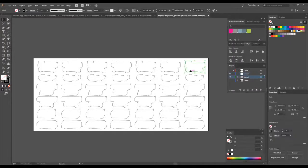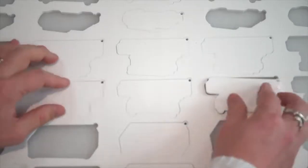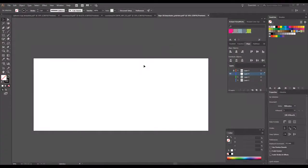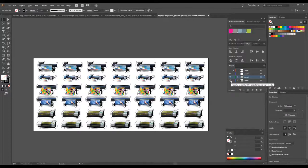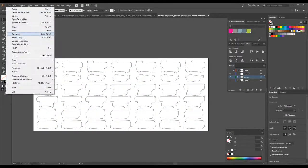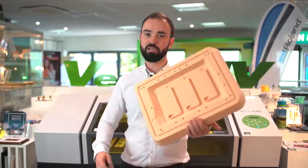For a laser cutter, all you need is the vector outlines of your designs. For a more in-depth or complex jig you may need to create, or have created for you, a 3D model which can be used to subtract from a larger block. If you do not have the technology to do this yourself, you may want to partner with a local supplier that can create the jigs for you. Remember that you will need to use the same template used for the cutting to generate your artwork file, so both must be scaled correctly — i.e. 100% — to match the bed dimensions. As an extension, you could create a mold and then vacuum form multiples of the outlines of your items, which would be perfect in a production environment.